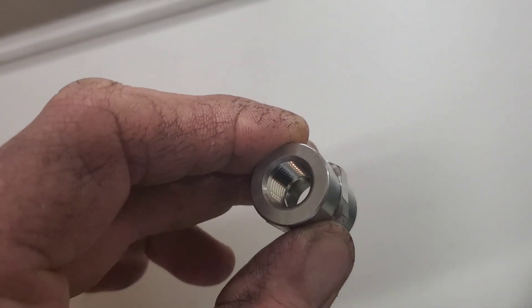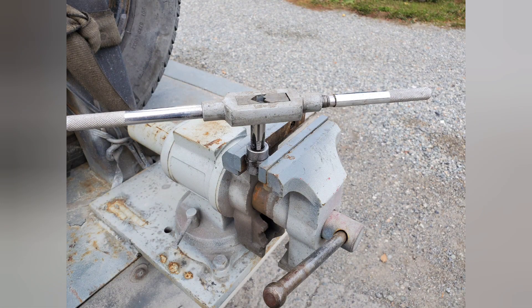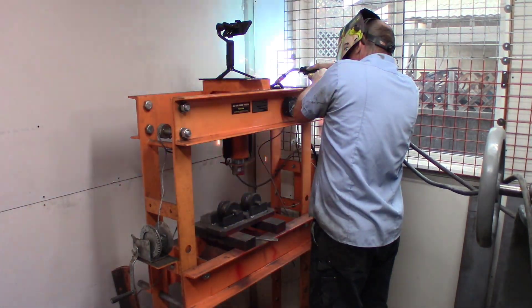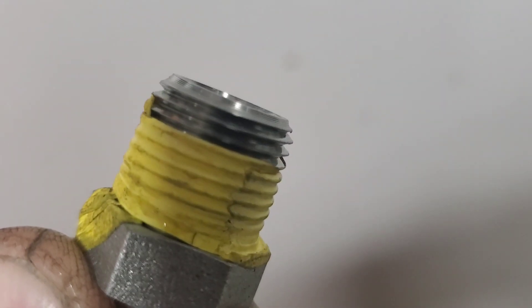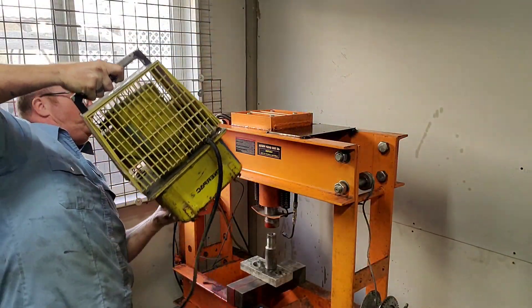The biggest challenge I had was the metric fittings that were on the press. A very extensive search was done, including friends phoning experts they knew, and they couldn't come up with anything either. But in the end I tapped it with an M14 tap and then welded it on. Always remember when using Teflon tape to go three threads down so you don't suck any of the Teflon into your system.